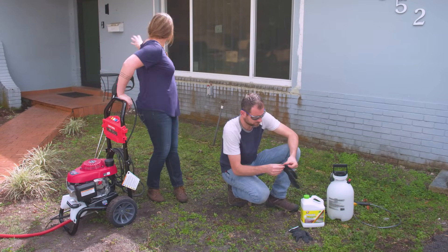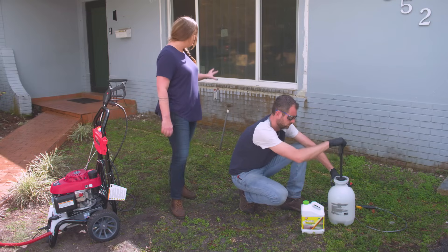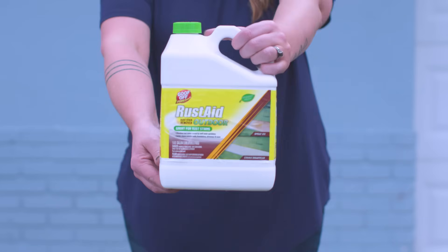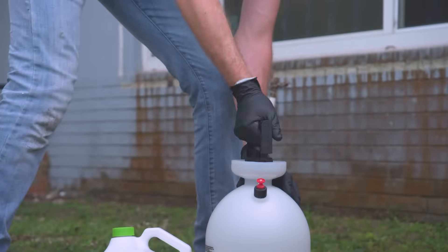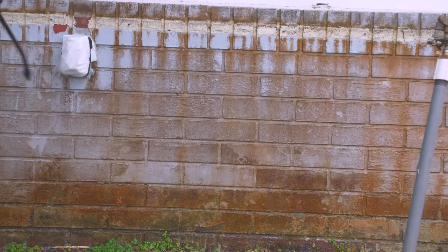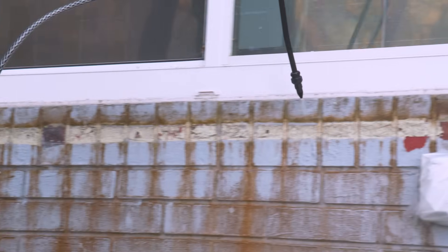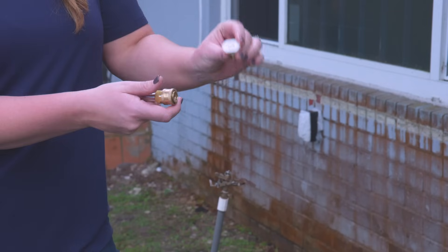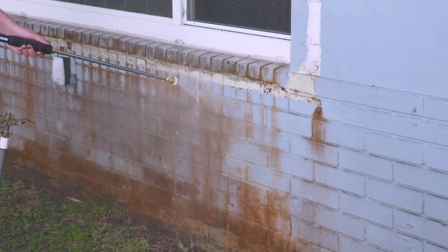The first side of the house is done. Out front we have a rust stain from an old irrigation system — pressure washing alone won't take care of that, and if we don't remove the rust, the new paint won't adhere to the brick. We're applying a rust aid using a pump sprayer, working from the bottom up so the chemical isn't dripping down and rinsing itself off. Once it sets up for a bit, we'll come back and rinse it off. Always read the label for safety precautions — this is a serious cleaner. After it sets, we'll use the 40-degree tip to pressure wash it off. With brick, you don't want to go too powerful — it could corrode away the mortar.